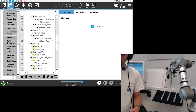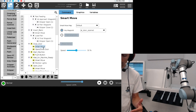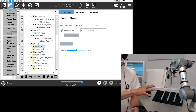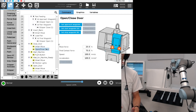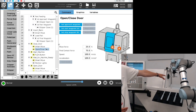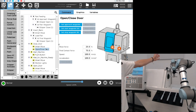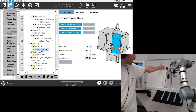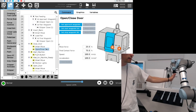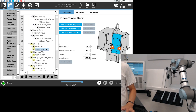In the macro list, when you go into a macro you always have the smart move — this is where the robot moves to a specific key waypoint and then performs a specific action. In the next step we'd close the door, since the part is already inside the machine. We're going to set a waypoint when the door is open and one at the end of the door stroke, and you can manage the force with this node.